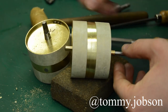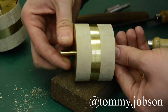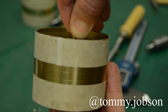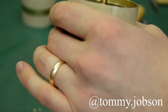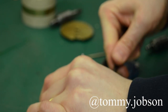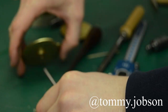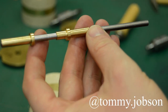You put it inside the barrel and then pull the two parts together so that they're flat up against the insides of the bushes. You can then remove the barrel cap — hopefully without disturbing the transfer gauge — and measure the distance that the gauge shows. That should give you the space inside the barrel between the two bushes.